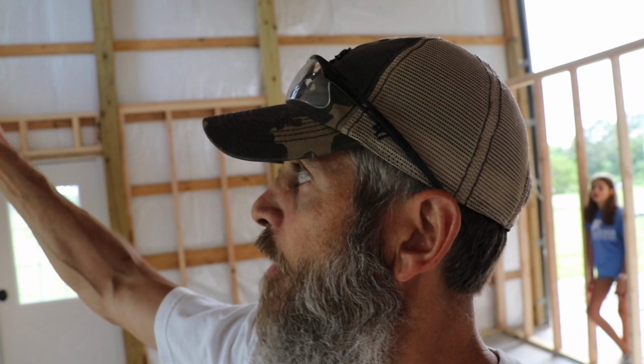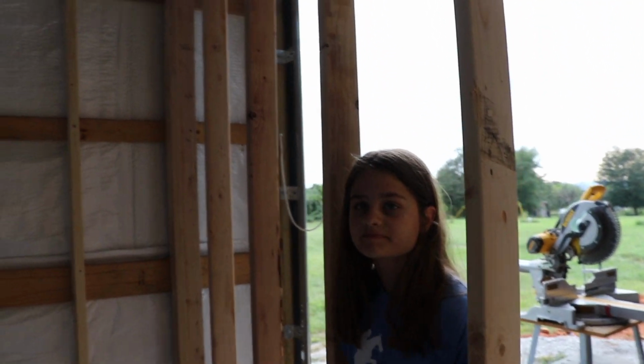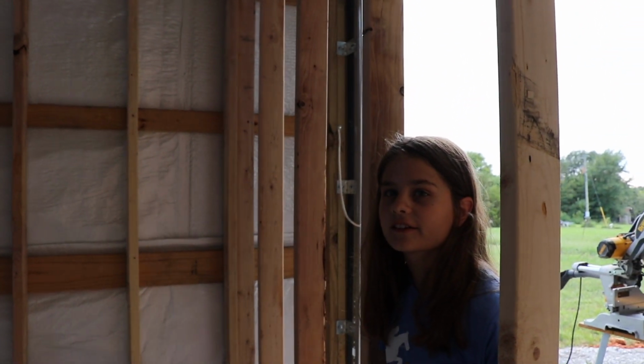So I'm going to double up on the outside here for the main beam part, and then 16-foot joists running this way, and then blocking between. That should be good. That'll hold you, right? Yeah, it should hold you. I'm pretty light. You're pretty light, yeah.